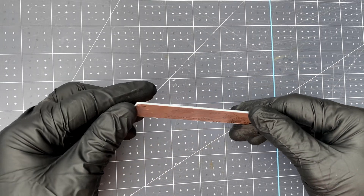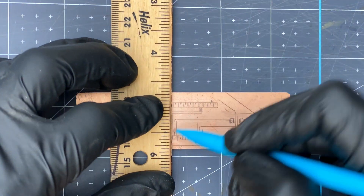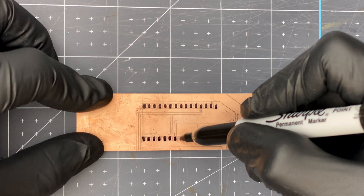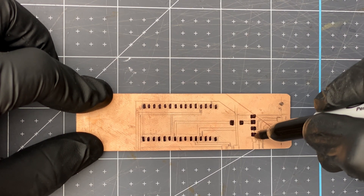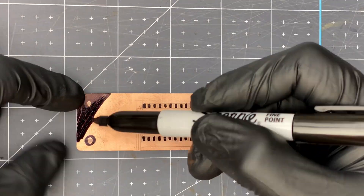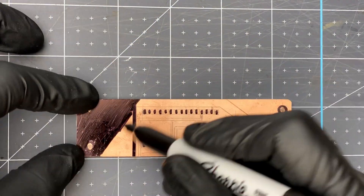As I previously mentioned at the start of the video, we used to build our own prototype circuits. You can do this by first planning the placement of your components and traces. Then use a marker to cover those traces. The trick is to cover as much area with your ground plane so that the ferric chloride solution only covers a small amount of area to work on, making the etching process faster.